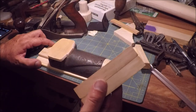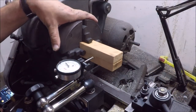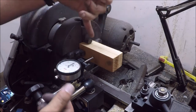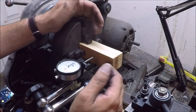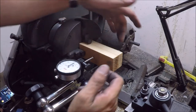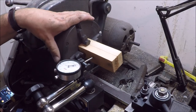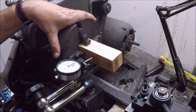I've got this thing chucked up in the lathe and we're going to see if we can get it centered. The main thing that's important is that this split line is centered. If it's off a little bit the other way it doesn't matter - we're going to turn it into a cylinder anyway. These two faces are the ones that really matter. I've roughly adjusted the jaws and put it in there.